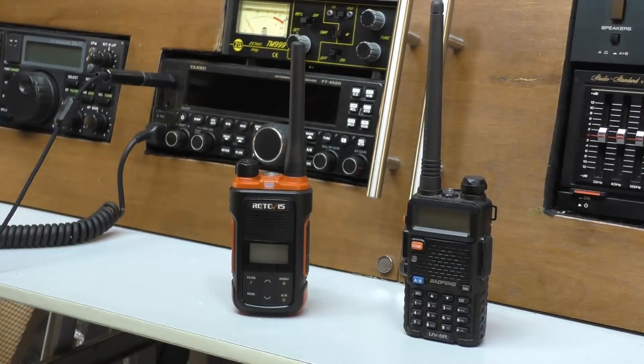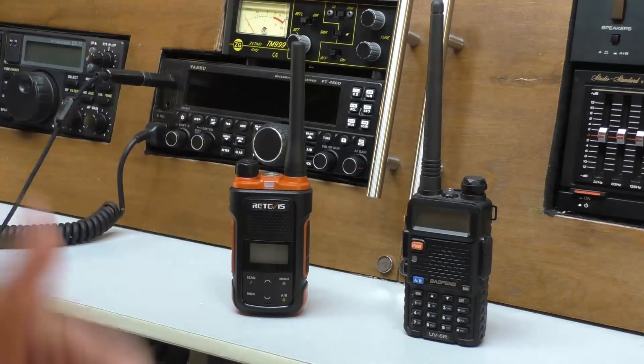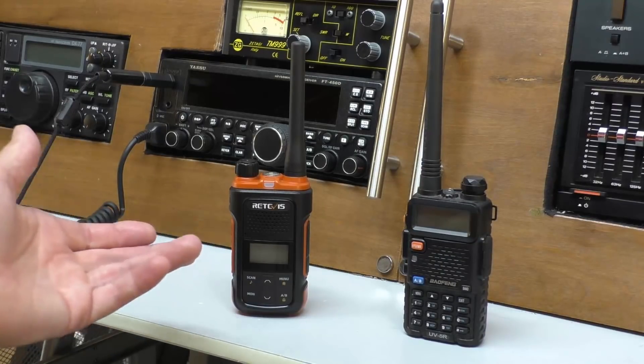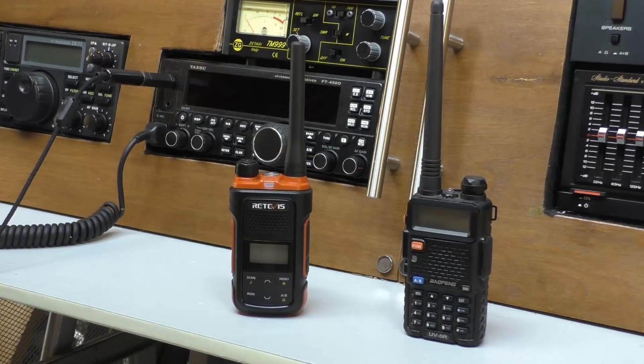Back up in the shack now. I had a feeling these radios weren't going to perform very well with that T2LT antenna. I'm certainly disappointed with its performance. I imagined that by getting that little 2-meter 70-centimeter T2LT up really high on a pole it would blow things away - better than the Antron, because the Antron was off frequency. But no, the Antron received a lot better. I've done testing from that motorway bridge PMR radio to PMR radio and it received a lot better than that antenna. A bit of a fail - also snapped my pole.